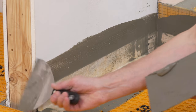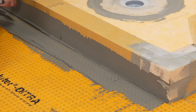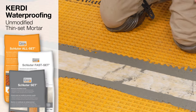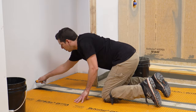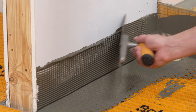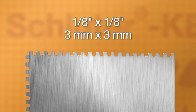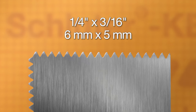Floors can be made fully waterproof with DITRA if desired by sealing seams and floor-to-wall transitions with Schluter KERDI waterproofing accessories. The KERDI accessories can be installed using any of the Schluter thin-set mortars or an unmodified thin-set mortar. The mortar is mixed to a fairly fluid consistency but still able to hold the notch. Use the Schluter KERDI trowel, which features a 1/8 inch x 1/8 inch square notch design, or a 1/4 inch x 3/16 inch V-notch trowel to apply the mortar.